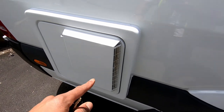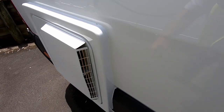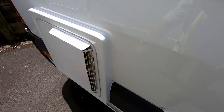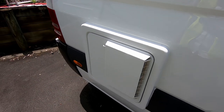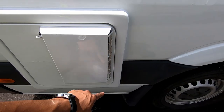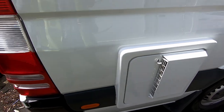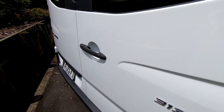This is the gas hot water heater over here. If you want to double-check if it's on from the outside, just run your hand up and down here — you should feel hot air coming out. On a windy day the wind can blow up and extinguish the flame, so in that scenario just turn it around so this side doesn't face the wind. You might also notice some water dripping out when it's finished its cycle — that's normal, it's just the overflow for the hot water cylinder.